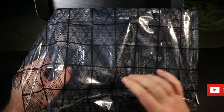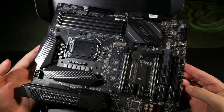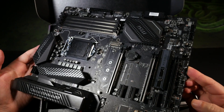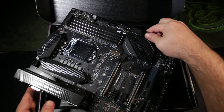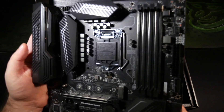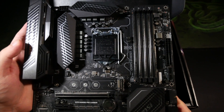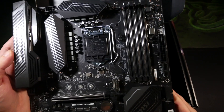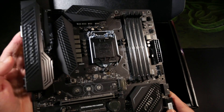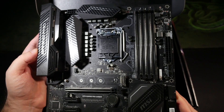On the face of it, it of course looks very much like you'd expect a motherboard to look these days. The I/O and the heat spreaders are capped with style touches. You've got your four DDR4 DIMM slots, and they sit where they always do. They will support RAM overclocked beyond 3800MHz, and the slots themselves feature MSI's steel armor slot reinforcements that premiered on the PCIe slots in previous generations. It's a bit pointless having steel reinforcement on RAM slots, sure, but it's a nice touch of consistency on the styling.